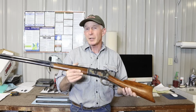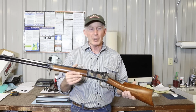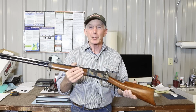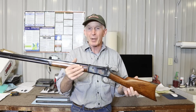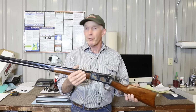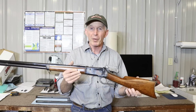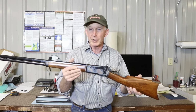But for those that you want to restore, that are good candidates for a refinish or a restoration, we'd be more than happy to help you with that. And there are a lot of options. Now, I don't want to make it look like there's only, on the one end of the spectrum, a fairly cheap refinish, or a make it look brand new again restoration, because there's a lot of options. And this 86 that we're using as an example today is an excellent example of that, in that this one actually came in for us to do the color case hardening work, which we did. It had already had the barrel and magazine tube caustic blued. I would have preferred to do a rust blue on it. The wood was actually in very good condition, so it was salvageable and looks really good just having it refinished. We can see just very little evidence of its previous life and the bumps and bruises, and it's still the original barrel, which has a good bore. So here's one that had restoration work, but it's basically a refinish.